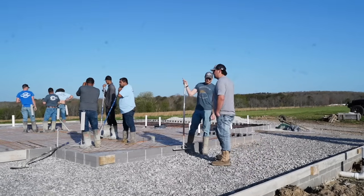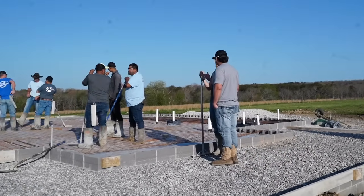So what we needed to do first is get the concrete on the main floor of the house poured. I think he said it was 4,000 PSI concrete? It was 4,000 PSI. And it also had fibers in the concrete to help hold it together, plus all the rebar, so that it'll crack as minimally as possible. And there's no settling underneath anyway. So hopefully that minimizes any cracks in the actual concrete. We did layer upon layer upon layer of trying to get this slab base as solid as possible, which we appreciated.